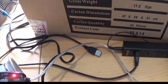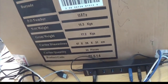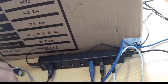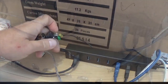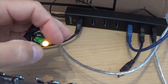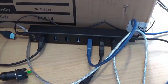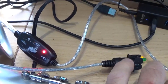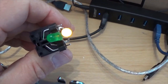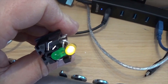So MIDI in is from the horn, goes through the MIDI-OX program, and out to the output connector. But now if I put my MIDI tester on the output, I can see the yellow LED is on continuously — which is not right. The interface still thinks it's working perfectly, but something bad has happened to the output.